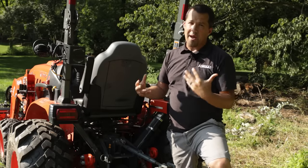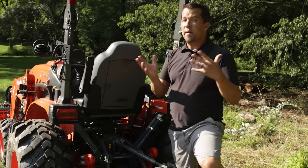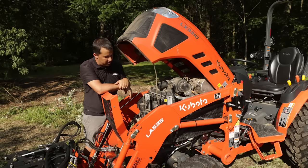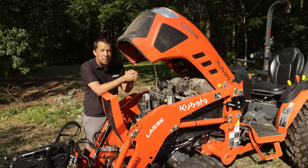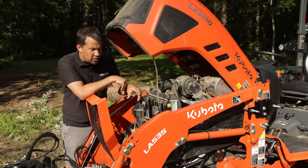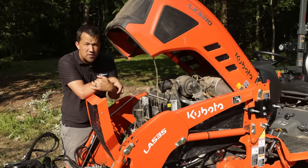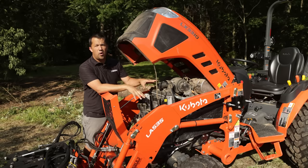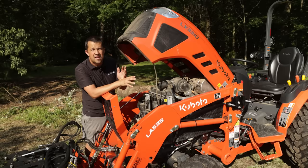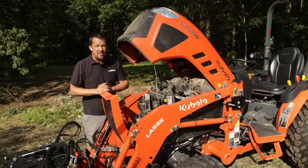At about a hundred hours, I've done mine twice and will probably do it again for a third time this fall. I like to fall into an annual maintenance routine with my tractor even when I'm not hitting those hourly intervals, because it's stored outside. The fourth thing to watch out for with a tractor stored outside — and something I could use advice from all of you on — is how to prevent mice and rodents from getting at a piece of equipment. The plastics and wires on machinery can almost taste good to certain rodents, and they can do a lot of damage very quickly if they get into a machine and start chewing the wiring harnesses, which can be very costly and time-consuming to replace. I know you can do things like add mothballs, or we sell a product called Cab Fresh that helps repel those things, but anything you can do to keep the vermin away from your equipment is going to help you in the long run.